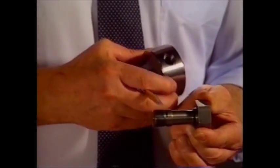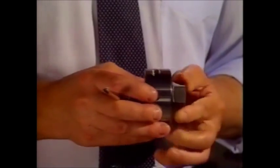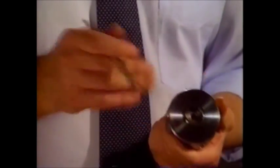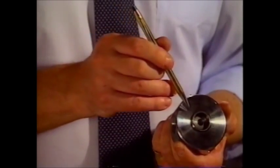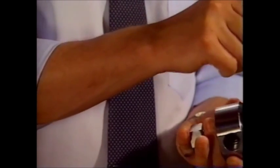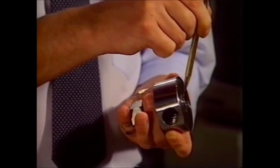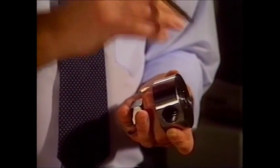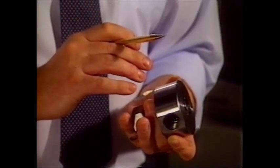This portion of the banjo bolt matches up with an exterior feature on the banjo body, which again shows a 15-degree taper here, which matches up with a 15-degree taper in the port to which the whole assembly is assembled.